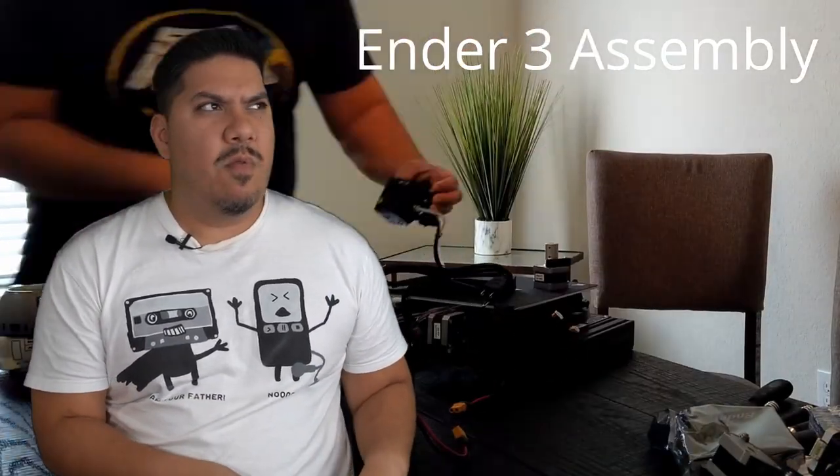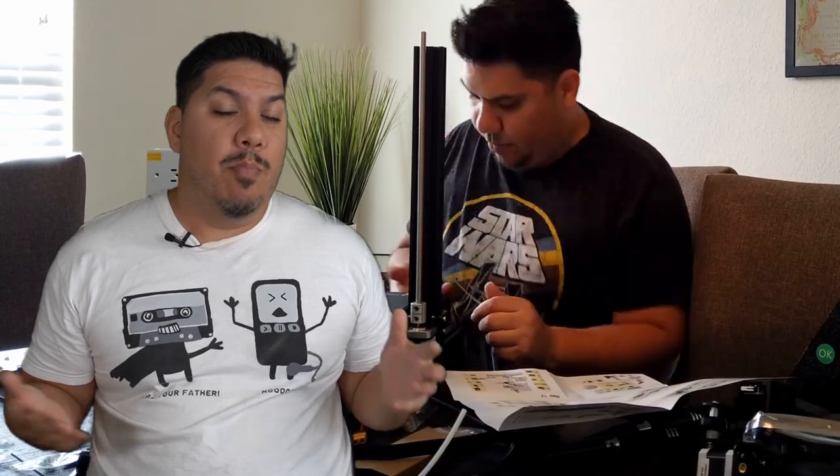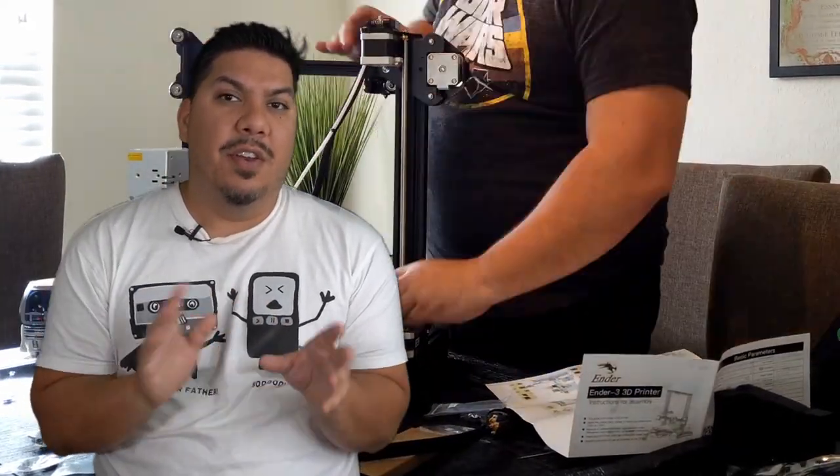One of the main things I wanted a 3D printer for — almost three years ago — was to print my own parts for FPV. I was buying a lot of mounts and 3D printed accessories and thought I could print them myself. It took a few years to figure it out, but here I'm going to save you that time. You'll also want to calibrate your e-steps — I'll leave a link in the description — and get your retraction settings right, which will differ filament to filament.